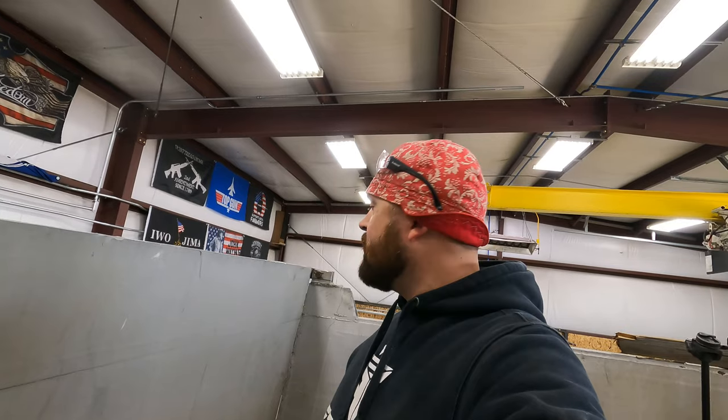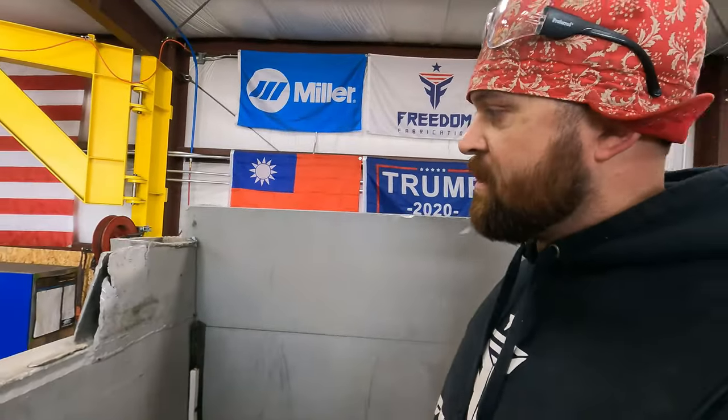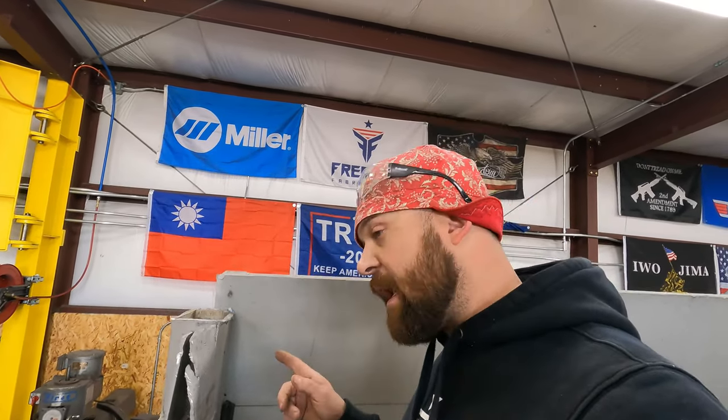And then there's all sorts of fun stuff going on, like using a bolt to hold the pin in. Instead of using a hairpin, they used a metric bolt over here. So yeah, that ain't coming out. So I had to snap the bolt off, and then I cut the rest off with the zip disc. So I got it off, pulled the pin out of the hinge. So I got it tore apart, but I'm probably gonna have to put it in the mill, drill a new hole, get a hairpin for it.